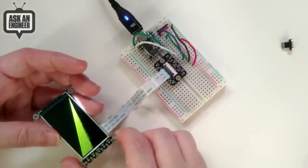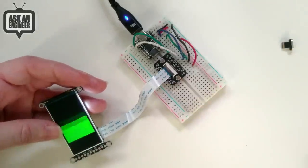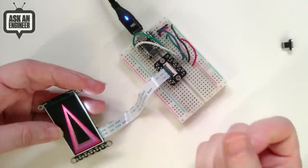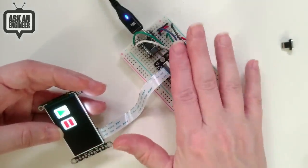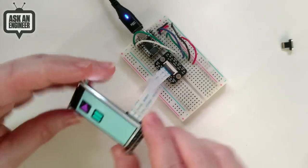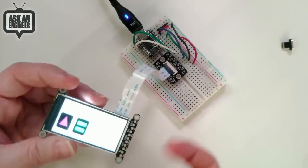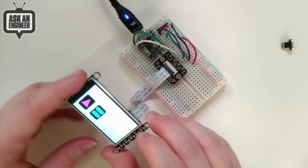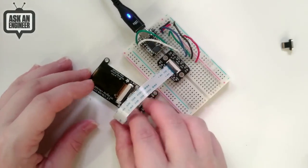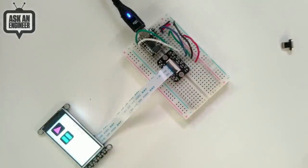There's also another issue people were having where they're like, why am I not able to pass the SPI, you know, 80 megahertz clock data so quickly through my jangly wires? It's like, well, you got jangly wires. This way you've got nice short breadboard wires and they go into the cable and the cable can snake out and then you can mount this wherever you like without having to worry about cables hanging up. It's a much neater collection. Of course, we'll have little add-ons that are designed for Feather Wings and Raspberry Pi, but we wanted to start with the breakout board version.